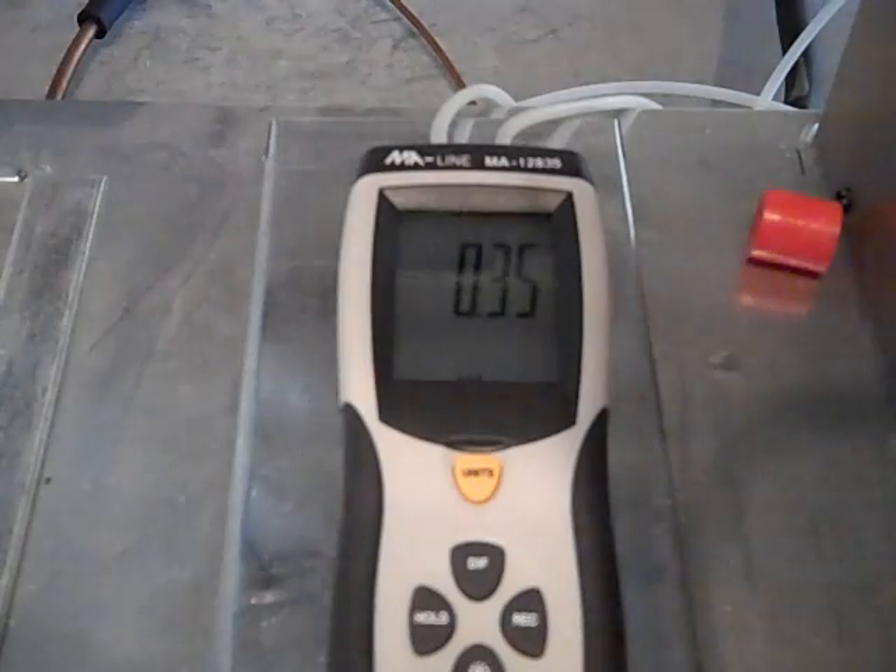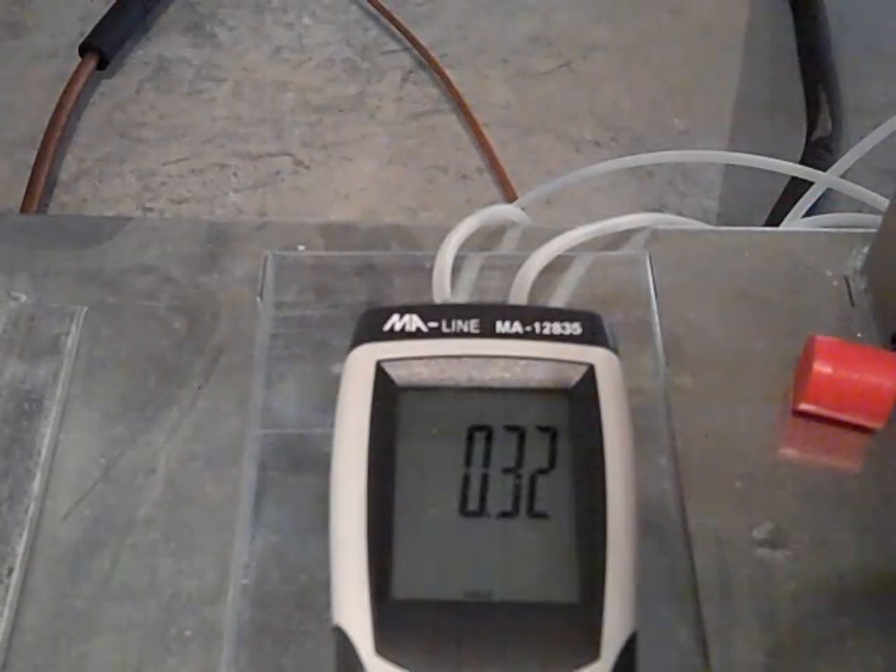That's between 1,200 and 1,158, so that's a little high. But we're going to do some adjusting. We'll see after I adjust the airflow on all my supplies and returns. I've balanced the supply registers as best I can — running out of daylight. Turns out my high speed is too high because my static is too low. That's duct work that's sized accordingly.